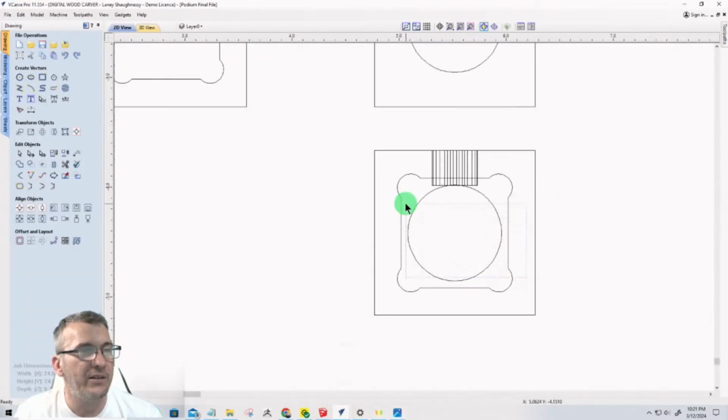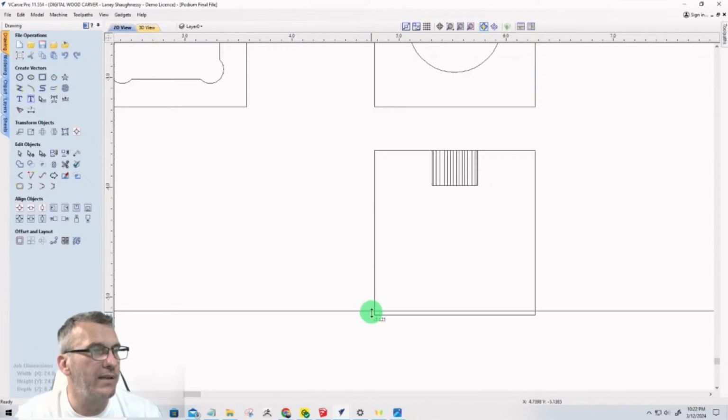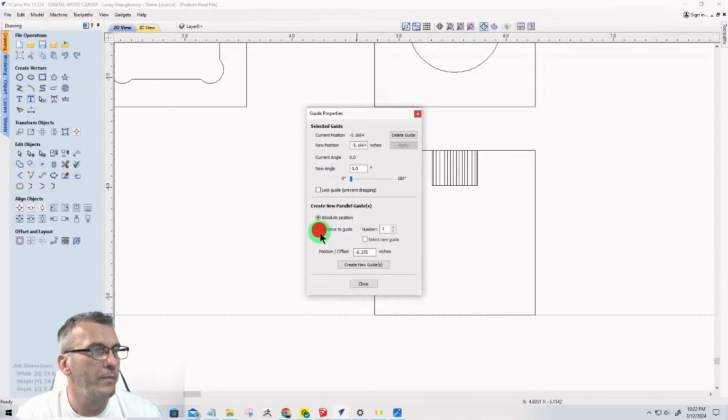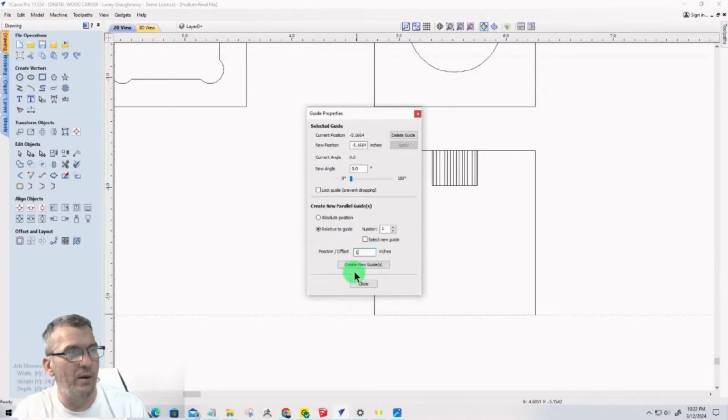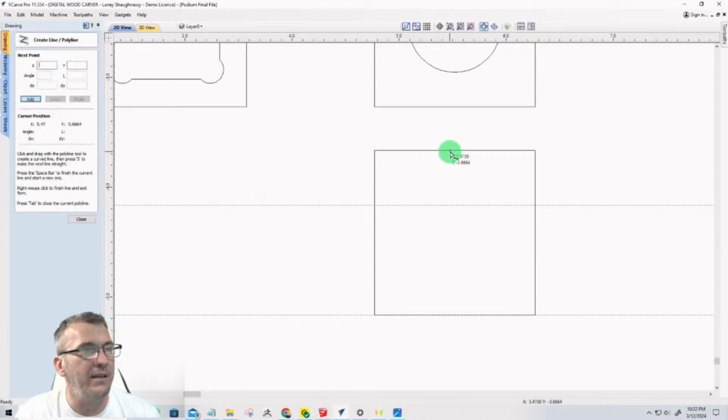here these vectors are going to go away. I'm looking at the side here, and I'm going to assume from the bottom up. So let's say from the bottom up, I have that 1 inch square pocket being cut in there, right? And that leaves this 1/2 inch here. I don't need those vectors anymore. I know I need to be centered left to right, and I know I want to be centered here. I'm going to draw a line at the center point straight down to this line here, 1/2 inch long. That way it gives me something to snap my circle to.